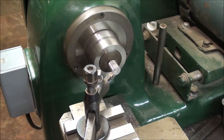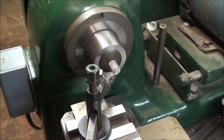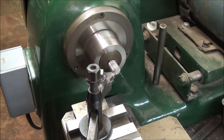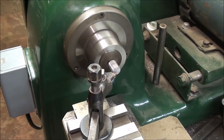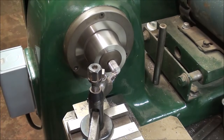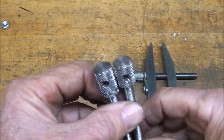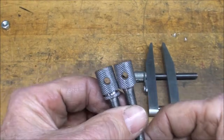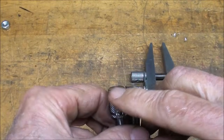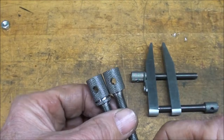And it is quite a luxury to have many different lathes. This is lathe number 4 that I've been working on today. I'll measure it with a rule until I get it exactly 5/8 long. There they are, almost done, faced, nice chamfer on there, and the chamfer really makes a finished look, so make sure you do that with a file.